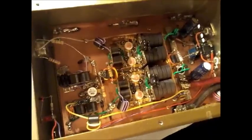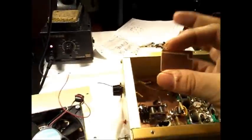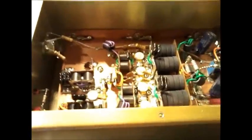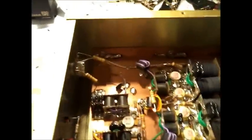Alright, old Gatekeeper, we're going to go ahead and get this side off right here so I can have some room to work in this thing. Got a lot of wires to run. Got a preamp to build too. Already got that right there cut out to build the preamp with the invert circuit. Got my little schematic there too. I haven't built enough of them to memorize them in my head yet. I've got to build about 50 of them. I think I've only built maybe 20, 25.